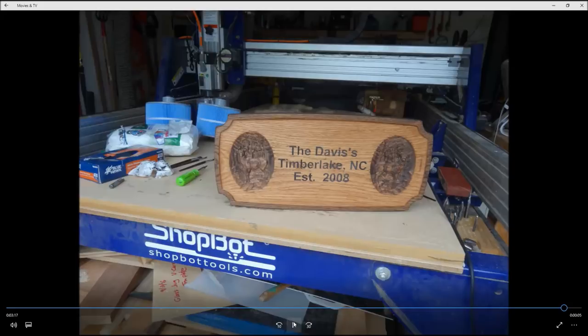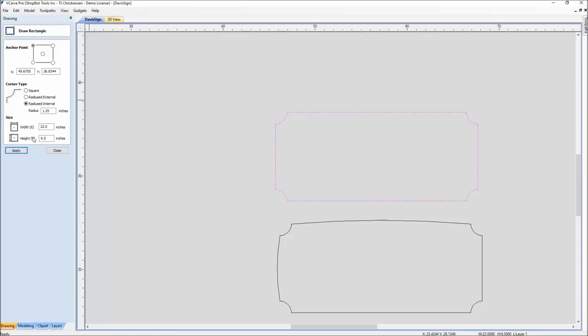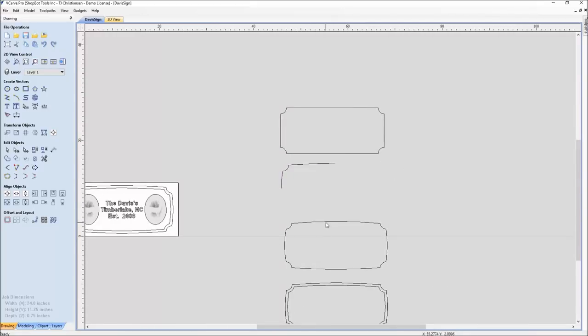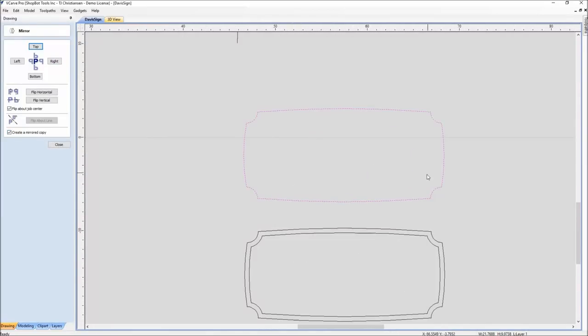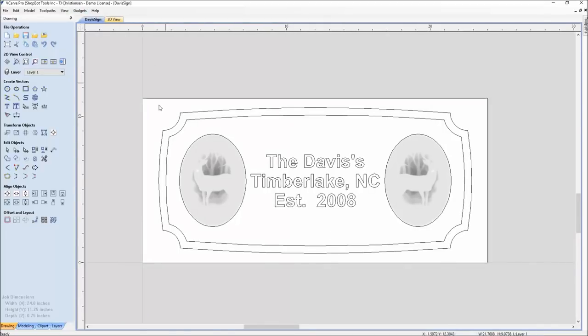To look at the file for this sign: I started with a rectangle using Draw Rectangles, adding corner arcs instead of a straight edge. We were going to cut away everything but the top left corner; using that corner I was able to use the mirror option — you can mirror it four different ways — and that's where I got my four different sides. Then I used the offset feature to come down and give it a little bit of a border.